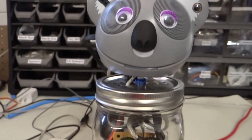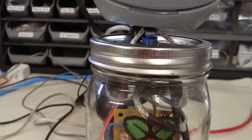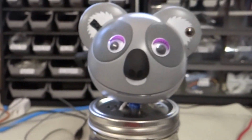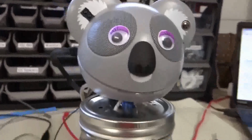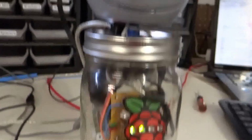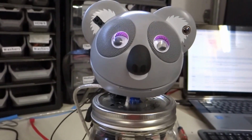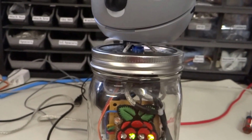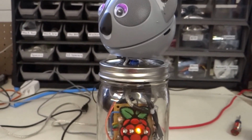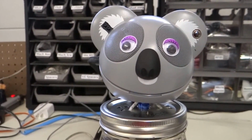Now, this robot also has a servo motor, which you can see right there, which currently has a little bit of a jitter problem. But if I move over here, you can see the LEDs kind of follow me, and as it turns its head towards me, it's able to detect where the heat source is if it doesn't move too fast, which it just did. So I moved too fast, but it's locking back onto me, and it found me.